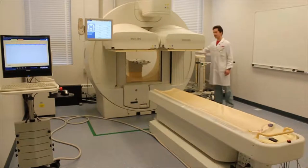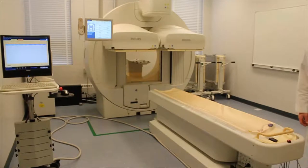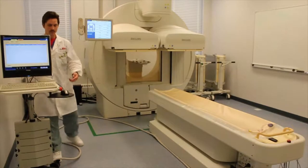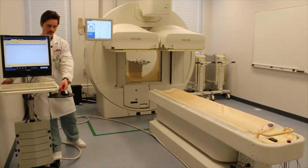After repeating the procedure for each detector, the next step is the emergency stop safety system check. There is one button on each side of the gantry, and one emergency stop button at the end of the imaging pallet. Engage, note the auditory response of the system, and twist to release. There is another emergency stop button at the acquisition station, and this one is pull-out to release.